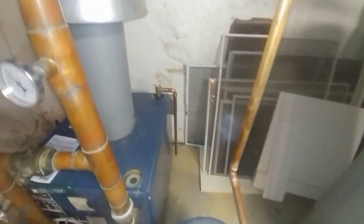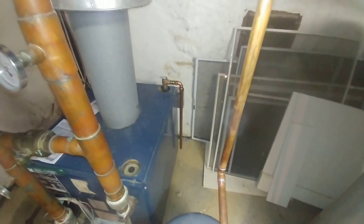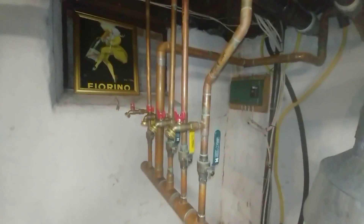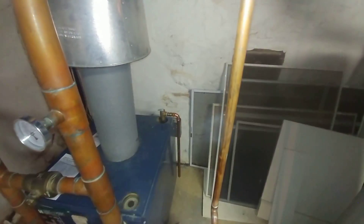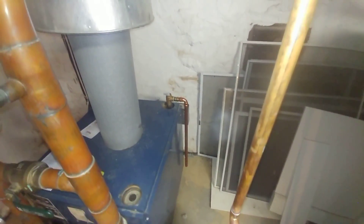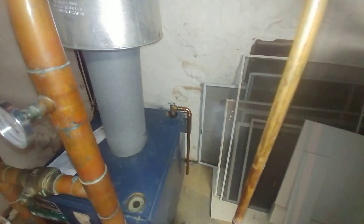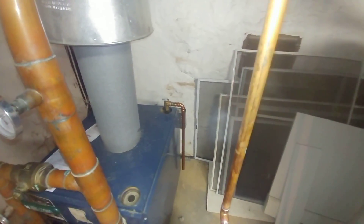The evidence of that would be the relief valve there dribbling all over the floor when the system runs. This system here has been zoned out fairly well and other people have come along and replaced that valve using ProPress. If that starts leaking and needs to be repaired, you'll probably need to cut that pipe, spin that off, and use another fitting.